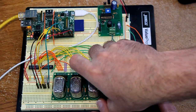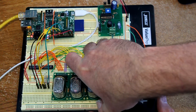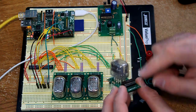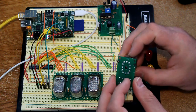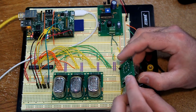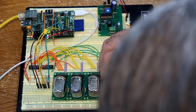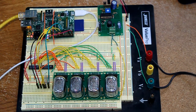I'll unplug the high voltage section so I don't get shocked. Here is an IN12 tube mounted on the pin sockets with the driver IC anode resistor. A couple pins here for the high voltage connection and these pins here for the ground and logic connections. Plug it back into place and plug the high voltage section back in.